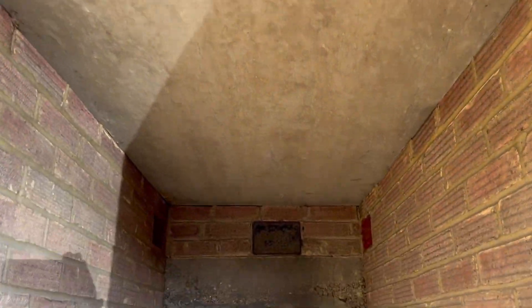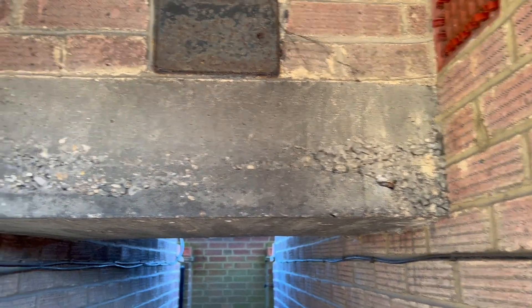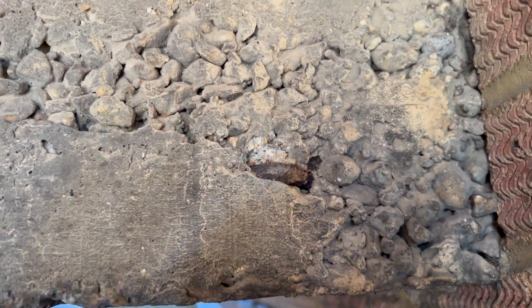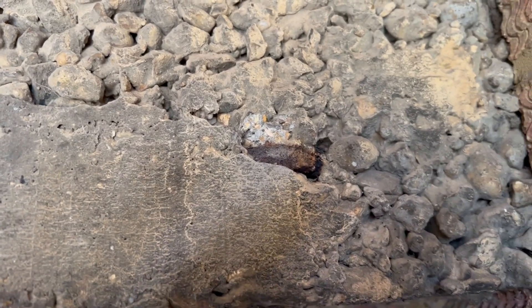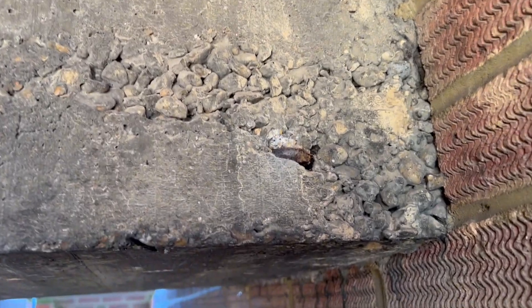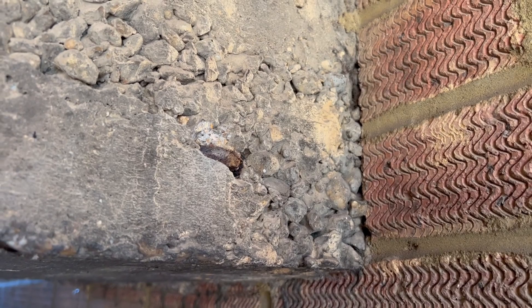If I take you back in here, you can see this is a rebar section forming a beam. What we've got here is a section of rebar that's only about one or two millimetres below the cover. But because this is underneath a protected walkway, it won't rust. That's the sort of issue you face — the cover between the rebar and the concrete generally isn't enough. If that were at the front of the building exposed, that would be really bad.